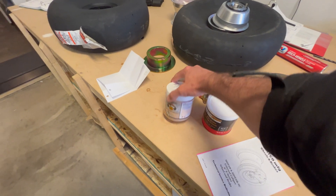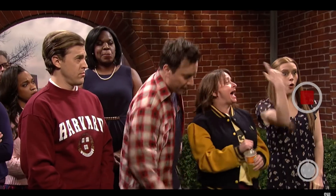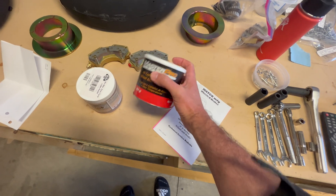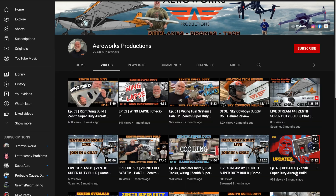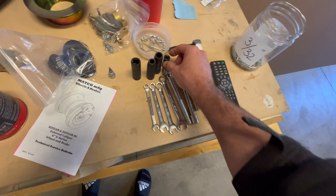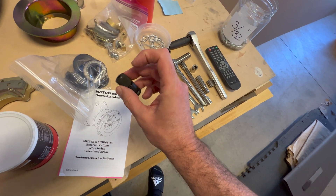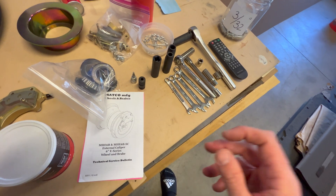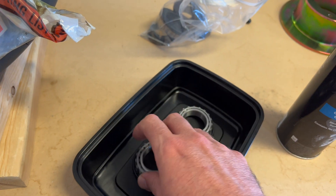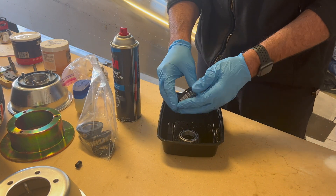Some stuff I bought — I don't think I needed this, this is a tire mount lubricant. And then this is some high-temp disc brake wheel bearing grease — you absolutely do need this. There's an awesome video, actually just discovered this guy — he's building a Zenith and he's got nice 26-inch Aeroclassics. We're going to clean the bearings and pack them with grease. I've got this socket which fits my three-eighths drive and can fit any sort of driver, and I attach that to the torque wrench to torque down rotational fasteners. We're supposed to clean off these bearings before putting in grease — they feel pretty clean but I'm just going to blast them with the brake cleaner. Other people do it with 100LL or gasoline, but this is what I have on hand.